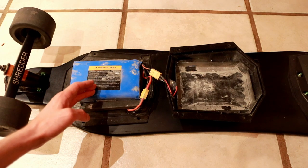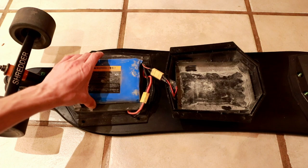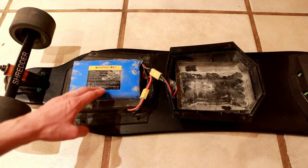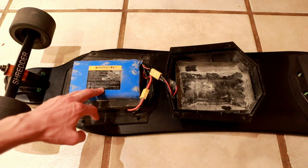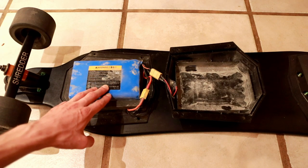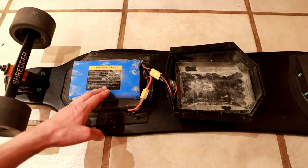I'm going to be using Samsung 36Q 3600 milliamp hour cells and because this is a 10S by 2P pack the final pack will be a 37 volt lithium-ion pack with a nominal amp hour capacity of 7.2 amp hours. It's going to be a big pack with lots of capacity, hopefully decently low internal resistance, although the 36Q's have a lower discharge rating at only 10 amps than many other high-end cells which typically have 20 to 30 amp peak discharge.